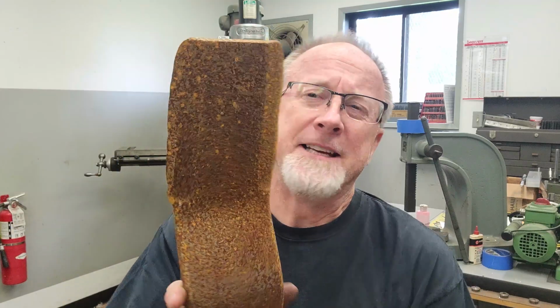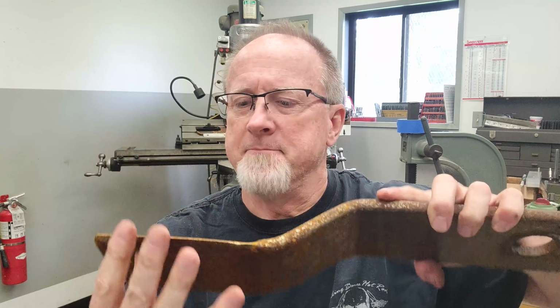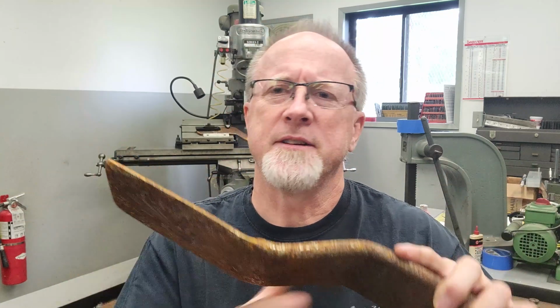There's probably going to be 15, 20 guys chime in on this about how to actually sharpen these things. Just to clear the air, after the military I worked on Air Force golf courses for about 10 years, so rotary and reel mowers, I'm fairly experienced with that stuff. I asked him how fast this thing turns, because taking a bunch of material off, we're going to want to balance them. He said turn slow, very slow, maybe 100, 200 RPM. So he's not worried about it. I still am, but that's why in my setup I'm going to face off this edge and bring it down to roughly the same. Hopefully none of them are worn unevenly, but we'll cross that bridge when we get there.